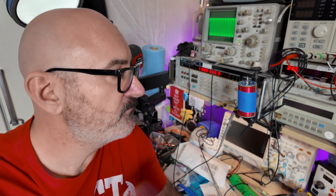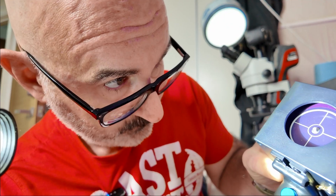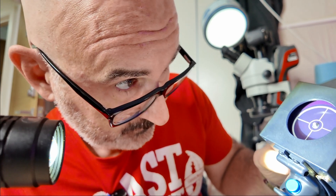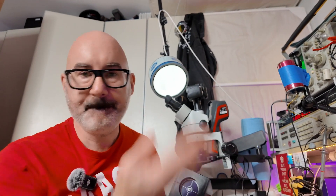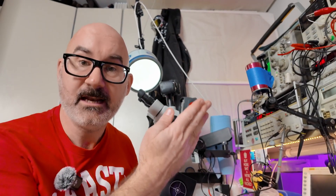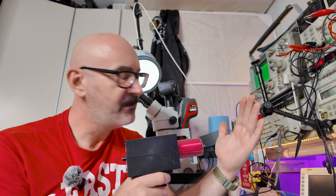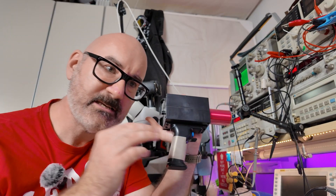So we know the resonance of this coil. Now it just needs to be energized, and that's what the rest of this box does. Inside you can see three or four stripes of copper on the printed circuit board that go around in a coil - that's called the primary coil, and that is where we're feeding in the frequency for a very short amount of time. It goes pew pew, and that boosts the voltage of the secondary up and causes lightning to shoot out. The spark goes so far. I think the reason why this spark shoots so far is because the frequency is very high - with each oscillation at 1.2 million times a second, it's creeping a little bit further out into the air, sort of finding its way along plasma fingers.